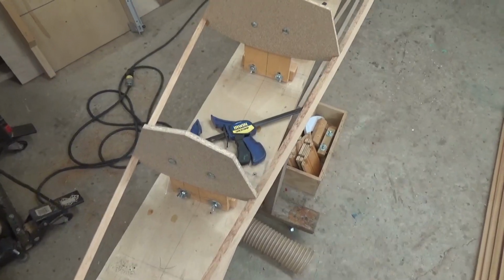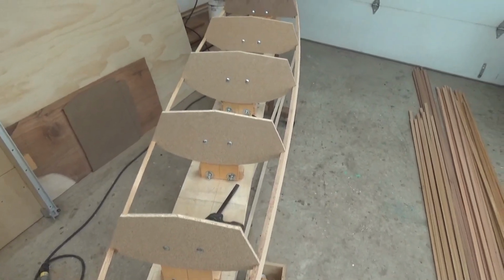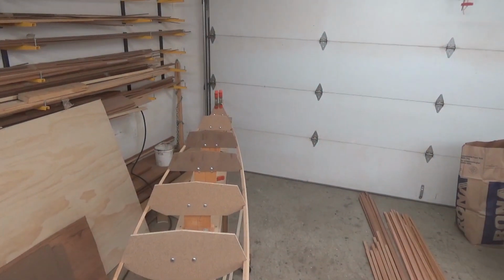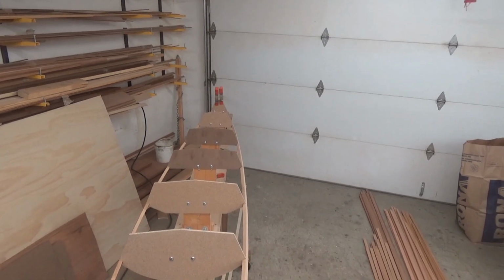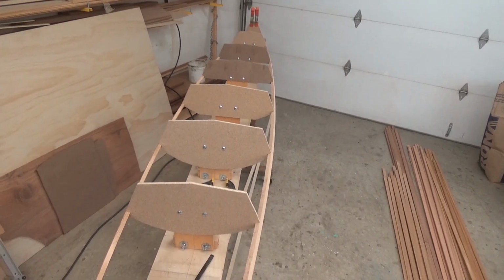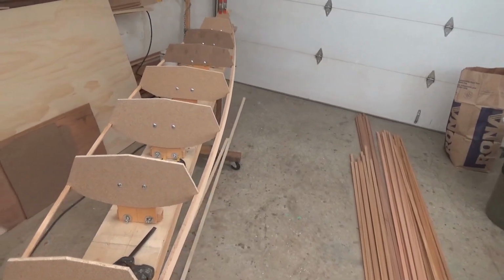With the shear clamps in place, it's now time to just look at the whole boat, the structure. Let's just see if everything is running smoothly down there. So look at it from the top, or the plan view looking down, and it looks pretty smooth. Now these shear clamps are 1/2 inch by almost 3/4. Quite a bit of it will be shaved down. So they're pretty stiff, and we'll push strips into place.